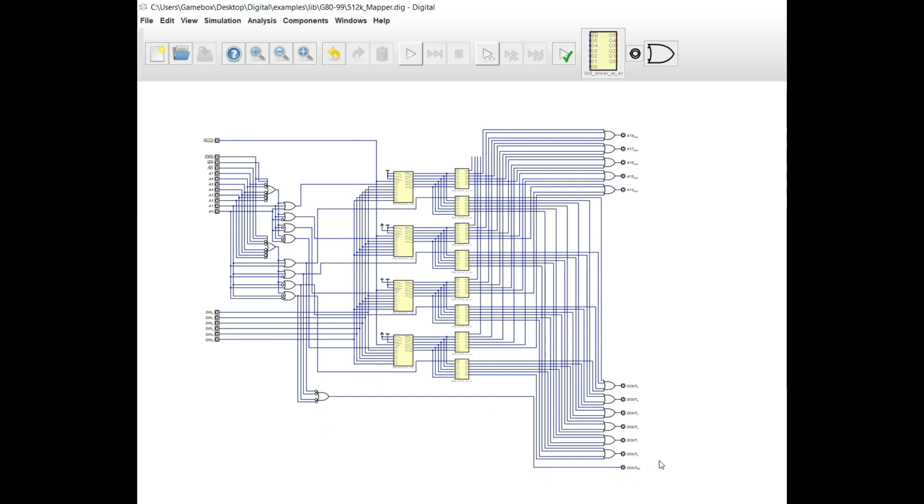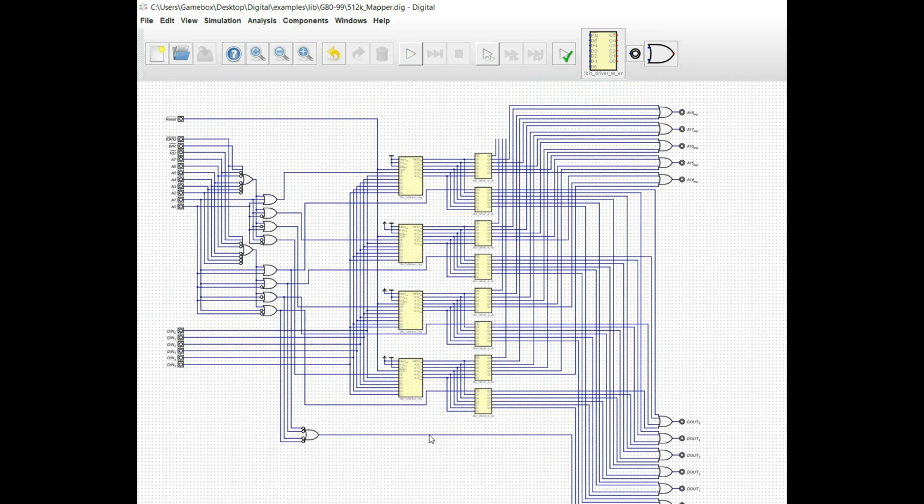So if you imagine this is all single little chips, such as this register chip here, imagine all this is inside one of those blocks. When we would hook something up to this, we would essentially put tri-state buffers on these, and we would use this signal here to gate those signals so that they are only being sent outwards in the event that this is a high. And that's kind of the purpose for that. But we still have some more work to do.